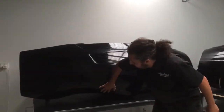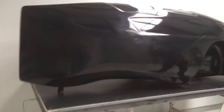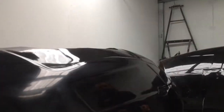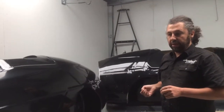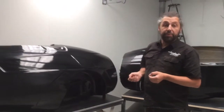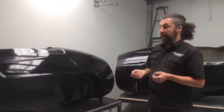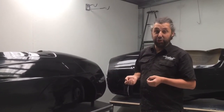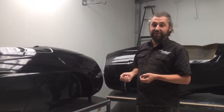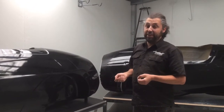You'll notice how much more developed the rear wheel arch is. And there's some stuff going on underneath to fit the chassis in. One of the major features of the Generation 3 chassis and Aquila 3 is our new carbon fibre high-volume wheels, which we're getting amazing performance characteristics out of. But it has meant we've had to completely rework our shapes to fit those wheels in. A good part of the delay in getting the new model ready is having to rework our nose cone model twice and body model twice to fit this chassis — which we're obviously extremely happy with — into the aerodynamics.